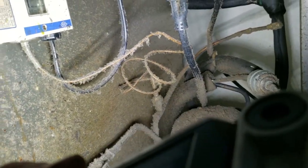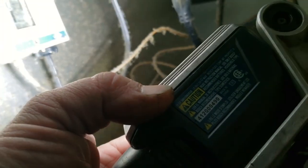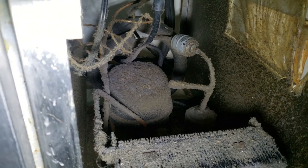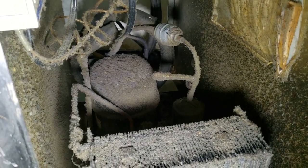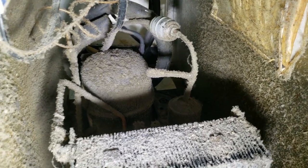This one's pressure-controlled for temperature, which — yeah, there — the compressor just clicked off. It isn't feeling very good. Yeah, it went off on thermal, so we're gonna check the start components first. Use your ears along with your eyes.